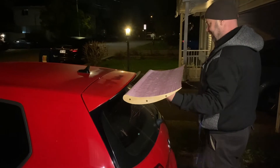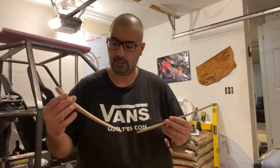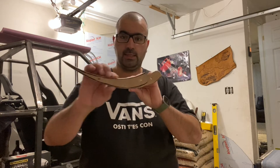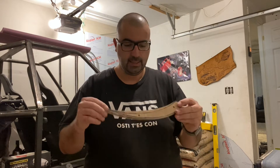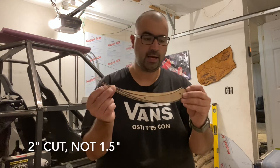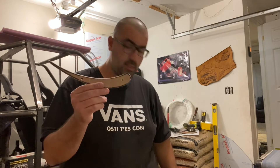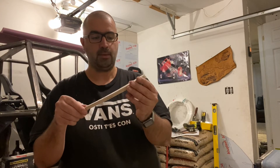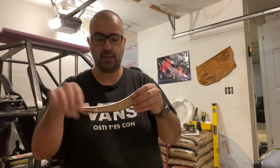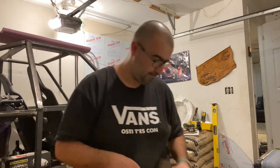Just finished building a second set of templates. Went back on the drawing board on the computer and designed a new set. This was the original set, this is the new set — almost identical. I changed the shape of the wing, a bit more aggressive. I knocked off an inch and a half of width, so that's going to be better and it's more curved in. This should be the final concept. Clean them up, make new plugs, screw both templates tight together and sand them so they're 100% identical — if you do them by hand separately, they'll never match.